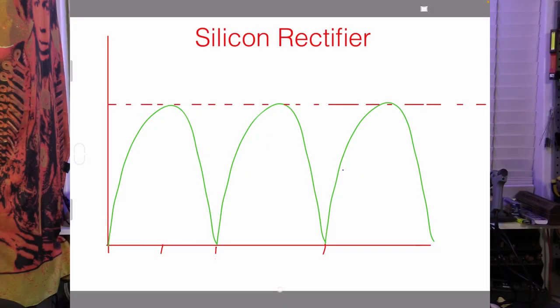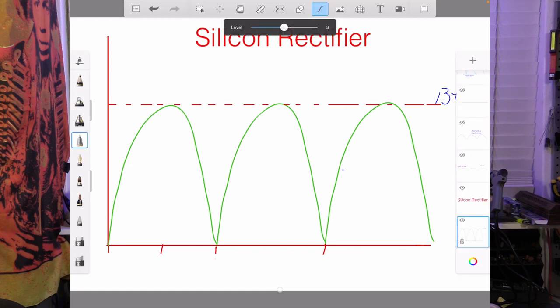So with a 180-ohm, 10-watt resistor, we're going to see a dynamic change — emulating sag — of around 20 volts. If you want more, double the resistor, et cetera. Now let's revisit filter capacitors and their effect on sag. Filter capacitors and rectifiers are a double act; one influences the other as you play your guitar. Let's take another look at the full-wave rectified DC signal after a solid-state rectifier. This level here is our maximum B+. Let's add a small filter capacitor — say 20 microfarads.